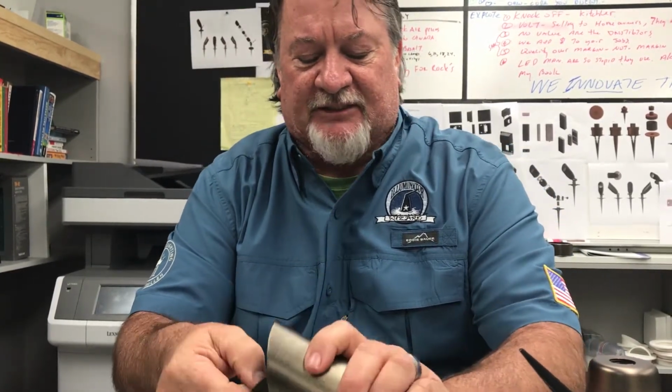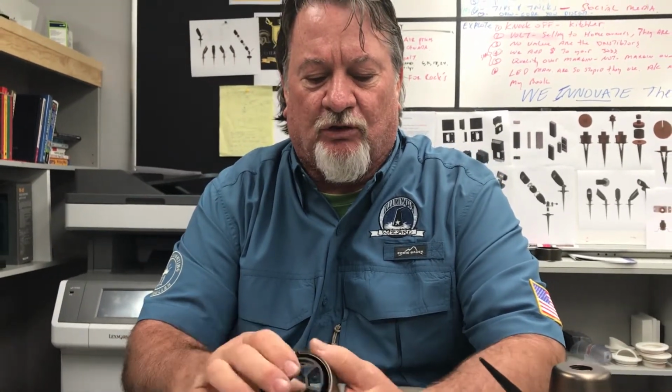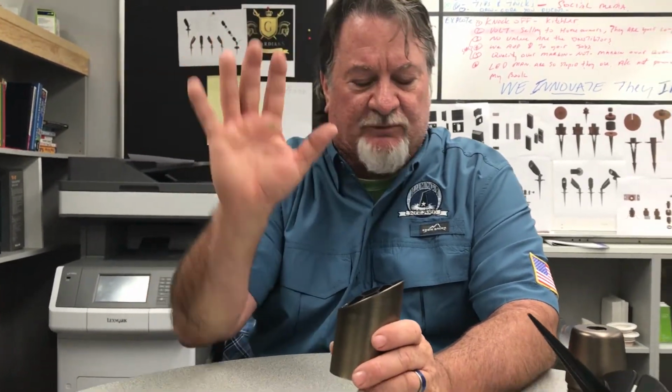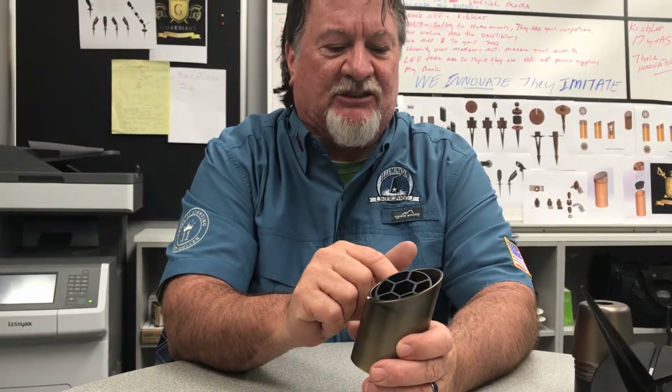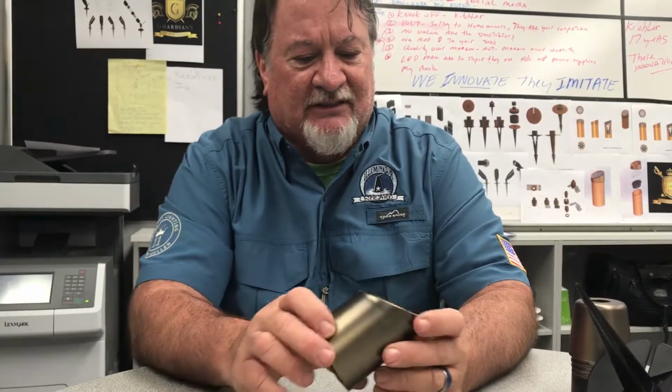The other thing, because the shroud is movable like this, I could drill a hole in the back of this shroud, because a lot of times the way the LED beam spread works, I need to tilt it back from the wall like this. Well, when I tilt it back, water can build up in here, and then it really messes up the lens. If I drill a hole in here now, water weeps out, and there's no light leakage because I'm blocking it with the inside of the hex louver.